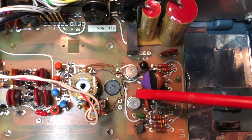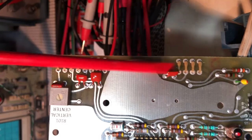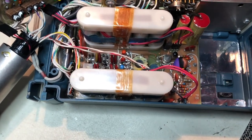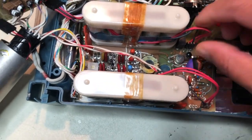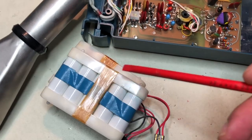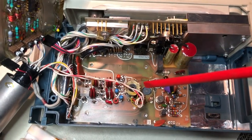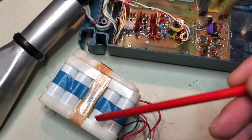That's the main switching transformer. These are the main switching transistors used for the DC-to-DC converter. You can see the power supply voltages coming into the amplifier board and the pins connecting the amplifier board to the input board. This is a working instrument unless I screw it up. The batteries are bad and you can take them out. These are NiCads, so they are definitely dry or dead. I'm going to replace them with NiCad — I don't want to use any other battery because the charging circuit in this is pretty primitive. It's a simple constant current charger.